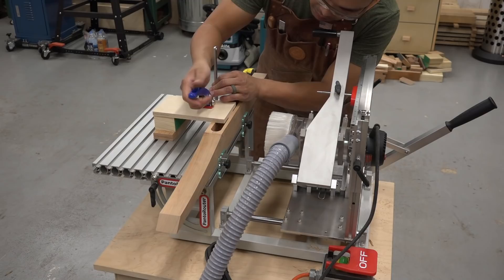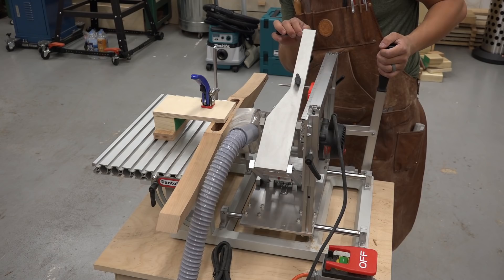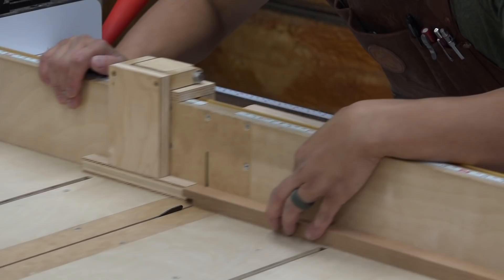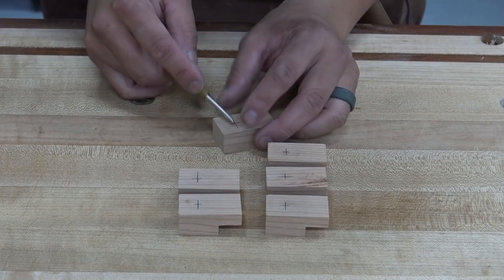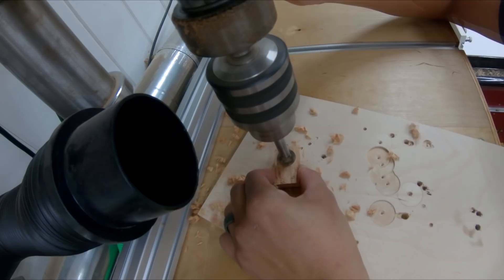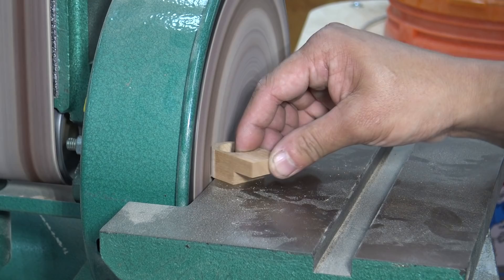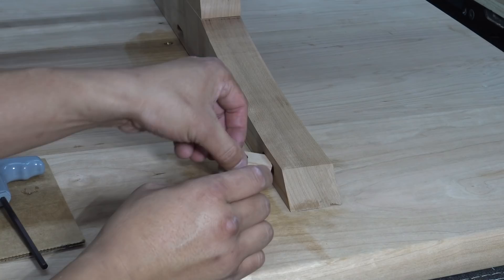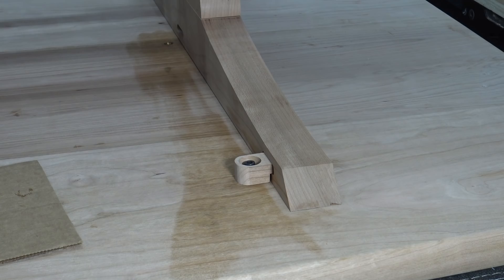I made and installed wooden buttons that attach the base assembly to the tabletop. I used the pantorouter to machine the elongated slots for the buttons. The wooden buttons were made on the crosscut sled of the table saw — essentially a half lap — then cut to final length on the miter saw, counterbored on the drill press, and shaped on the disc sander. I then glued and installed threaded inserts before attaching the wooden buttons, which securely fasten the tabletop to the top brace while still allowing about a quarter inch of seasonal wood movement in both directions.